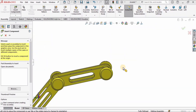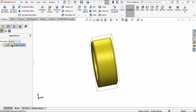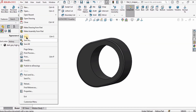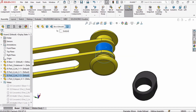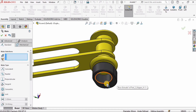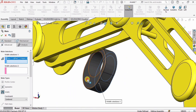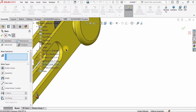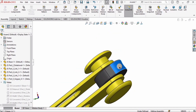I'm going to change the appearance of the gripper part — this is totally optional. I'll select this face, click on Mate, assemble it, and check the box. Then go to Advanced for the Width mate: first selection, second selection for width 1, first selection, second selection for width 2. Done. Make sure the hole is facing outside.